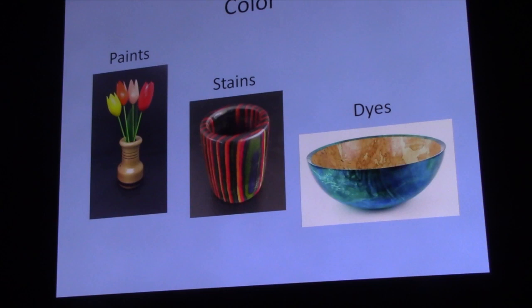Yesterday when we had the dinner, there was a piece of wood there that was about that long that felt like it was about 3 or 4 times heavier than it would be if it had been kiln dried. That's because it was loaded with water. To turn a piece of wood that's wet, you've got to do a couple of things. You've either got to turn it to its final size, hoping that what's left will evaporate and not change the shape, or you've got to leave it 10% of the wall thickness because it's going to distort. Whenever you turn a wet piece, it's going to distort, so you have to leave room to come back and clean that out. Is that right? Right. I did read the right article.